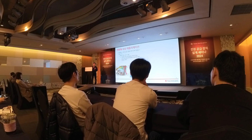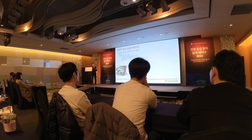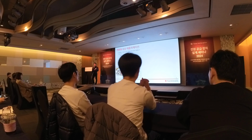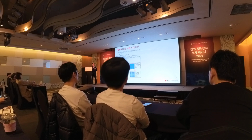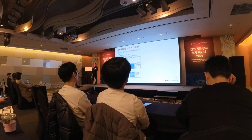a slew rate of around 2.5 amp per microsecond. But for GPU load, we have seen some people asking for 10 amp per microsecond here. So it's really tough for us to meet that requirement and meet the output voltage regulation under this load. But it's proof that phase shift full bridge converter is able to do that.